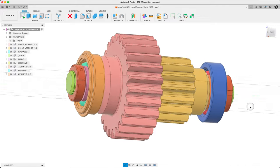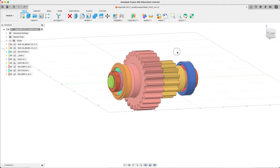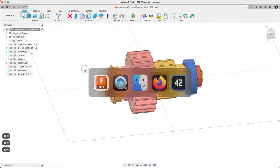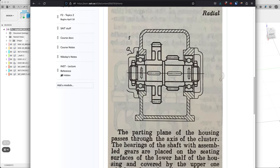What we're looking at here is a standard, quite compact shaft with two equally sized bearings — 6305, both from SKF. The NR here is for the ring. We're going to be doing a radial assembly here.